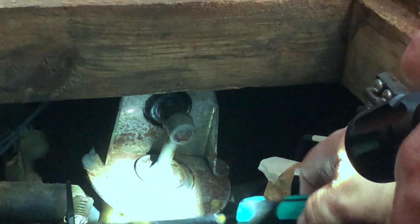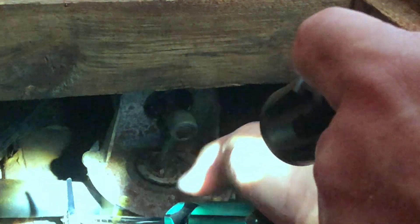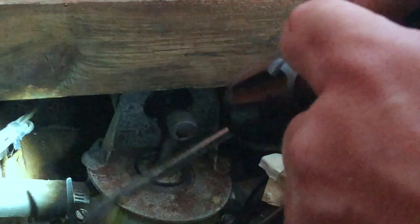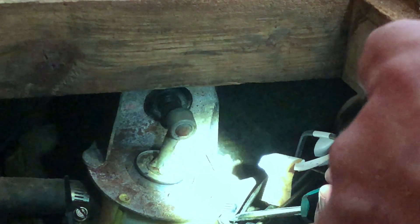Alright, we'll get a little light on the subject. I'm going to start by trying to take off this hose here — this is the output side of the sump, the overboard discharge hose. Let me loosen this up. This looks like it's in there pretty good. May need some heat to get that off. I'll go ahead and undo this one also — loosen it up. There's the intake side. It helps to put the light on the screw head so you can see what you're doing.